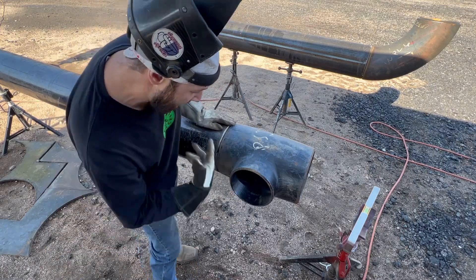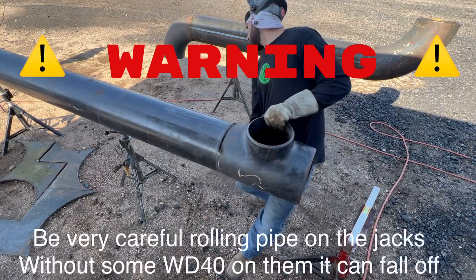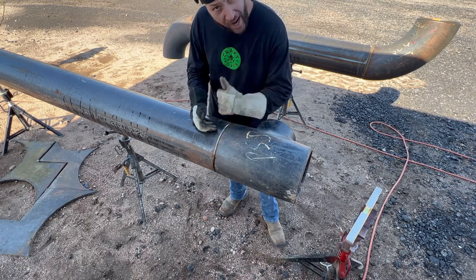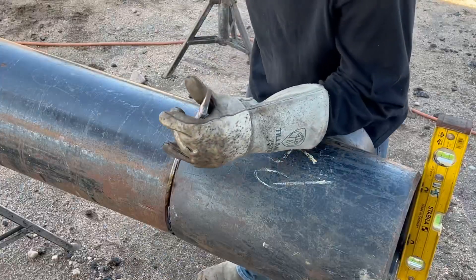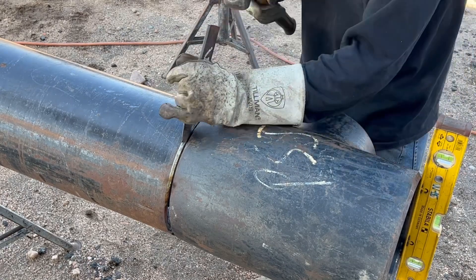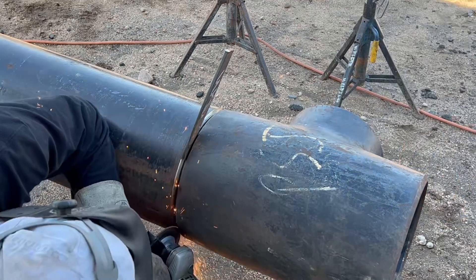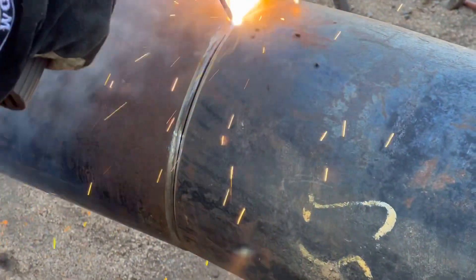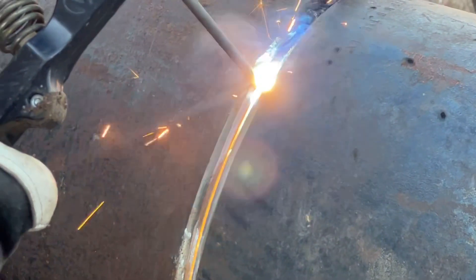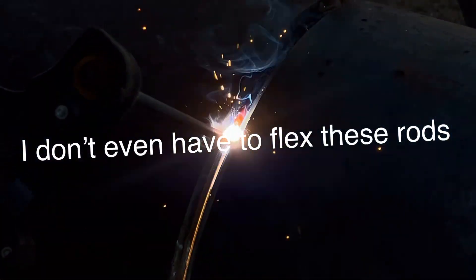Now, this is the big gap. The tight gap is at the bottom. My suggestion is always roll the tight gap to the top. If we roll the tight gap to the top, it's easier to get a wedge from the top than from the bottom.